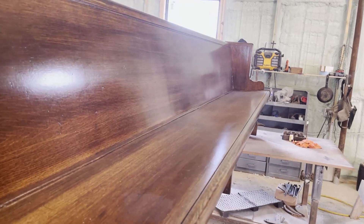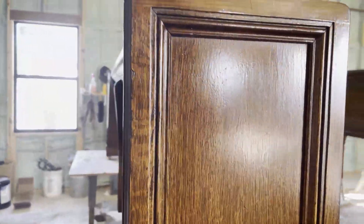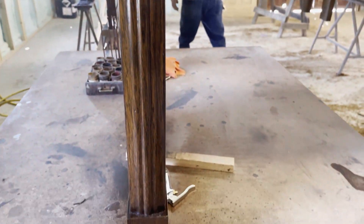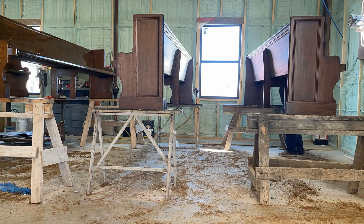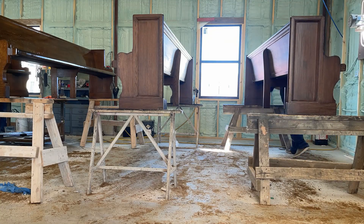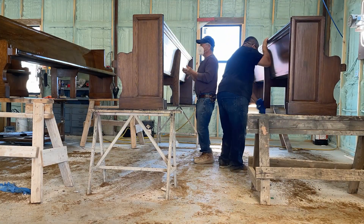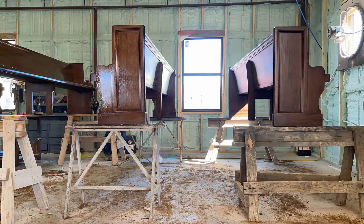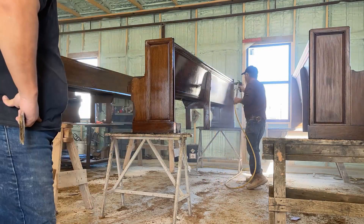The reason we're using polyurethane instead of lacquer is because of the amount of abuse and physical contact that these church pews are going to go through. Lacquer would be better for a piano or any furniture where the wood is not going to have as much physical contact. I think the end product came out amazing. All right, two more to go. As my dad sprays, I'm following behind him to look for any spots where the material may be running, so I can lightly wipe away the excess material with a brush.